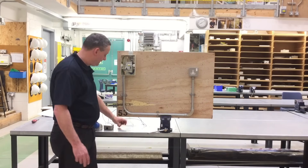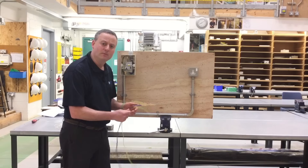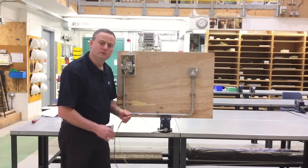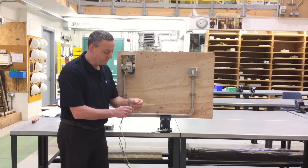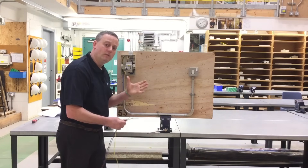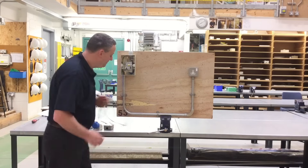When wiring our conduit system we use single insulated PVC cables. PVC stands for polyvinyl chloride, and we're using thermoplastic PVC cables which have a maximum operating temperature of 70 degrees. We can also get thermosetting cable, sometimes known as cross-linked polyethylene, which has a maximum operating temperature of 90 degrees C. They are constructed from stranded copper for greater flexibility when being pulled in, and the circuit is wired in 2.5 millimetres squared for all conductors.